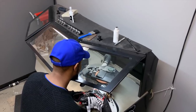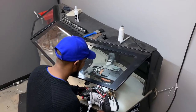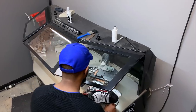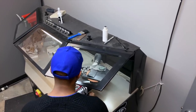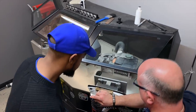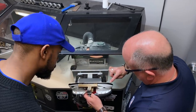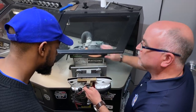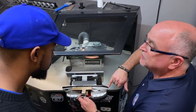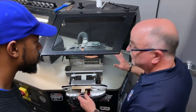One more time — no pressure. If you fall, it's your fault. There you go. Now look — you still have some over here. See how you were pushing a little quicker on the toe? That's why it's darker — you're putting a little too much pressure, and that heats up the blade. It's very important to keep an even flow.